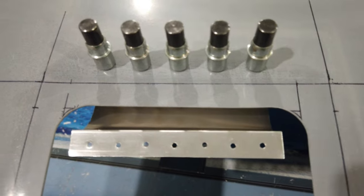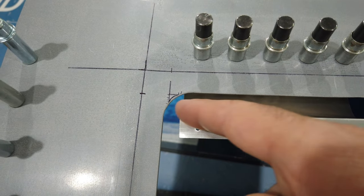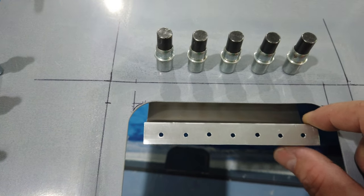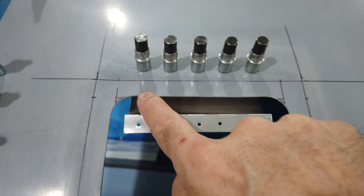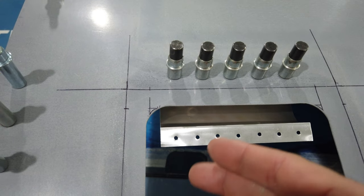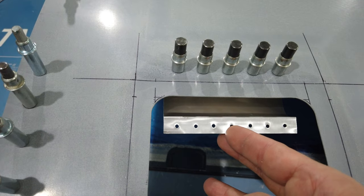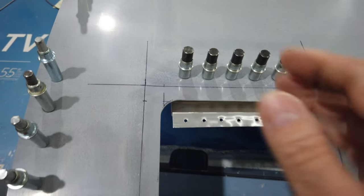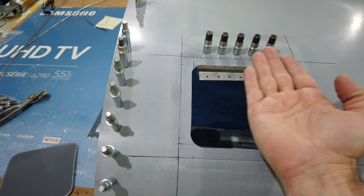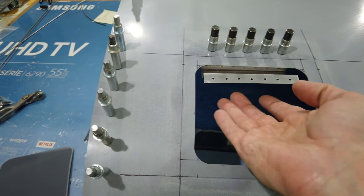Another thing to check: this edge to the back edge of the flange should be parallel. This is thin metal so I can tweak and bend it to get it parallel to the back edge — I want it nice and square. It will stiffen up once the door is on and riveted. So I'll make sure these are parallel, put the door in place and tape it down, come up underneath, position the hinge, bend the flange flat against the door, mark the holes, drill them, cleco everything together, and see how it works.